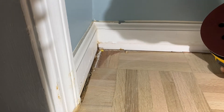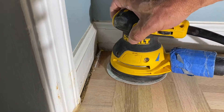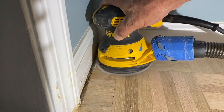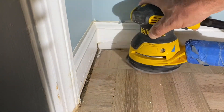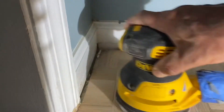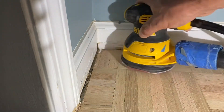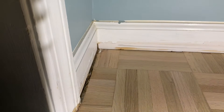You just slap your paper on there, hook up your vacuum, and get to work. Using the palm sander first, you can push it right up into that corner and it'll do most of the work for you. You also run it along both edges — most palm sanders can get really close, right up to that baseboard, giving you a nice clean edge. Then pull it back and taper it out into the field a little bit to ensure a nice smooth level finish with no streaks in your floor.